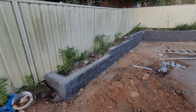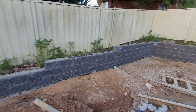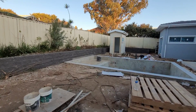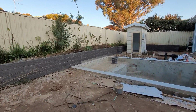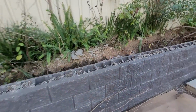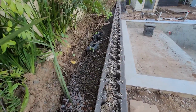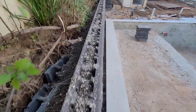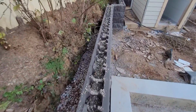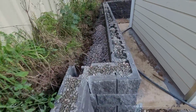As you can see, the wall is completed in 2 courses, 3 courses and 4 courses all around the garden. We line each course and also leave the top one open for the capping later. Let's go through, and behind fill up with the aggregate, and any leftover blue metal is going to the back of the wall as a drainage.